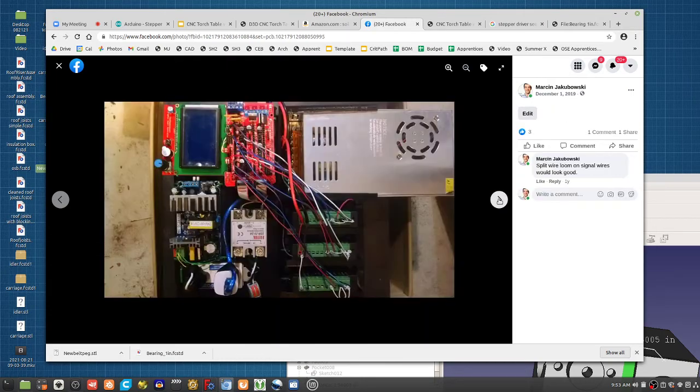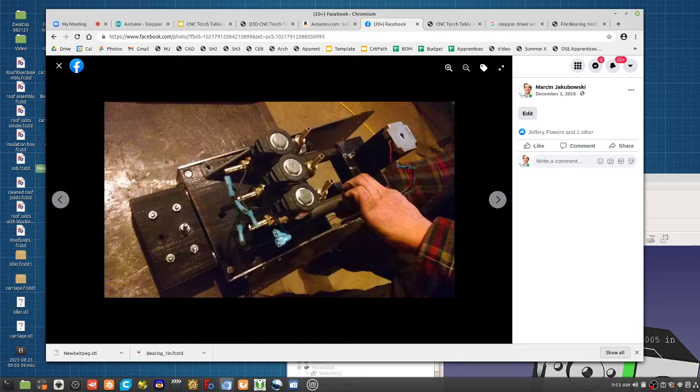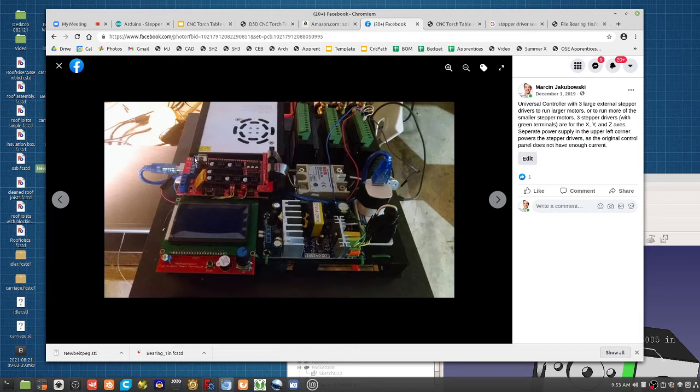It's shown here. We actually mounted this on the back of this. Back other side, we have the igniter part. So yeah, the point is that you have access to a bunch of pins. Like here, these are already pre-wired terminals that you can use to turn something on and off. You can use these directly for small loads, like a couple amp load. For example, the last one, the D10 outlets there, can support a couple of amps.